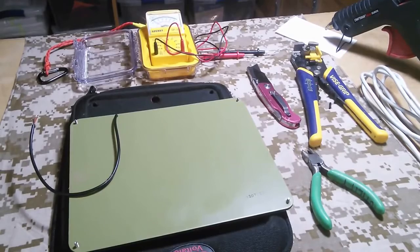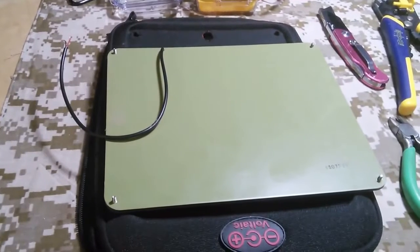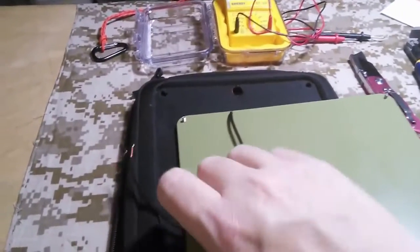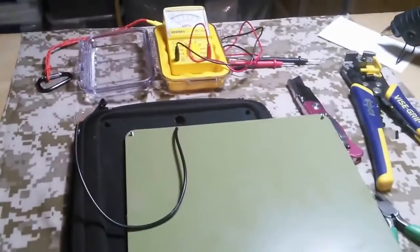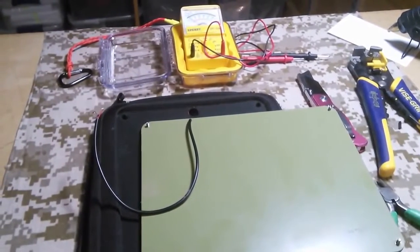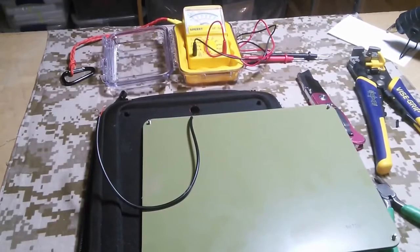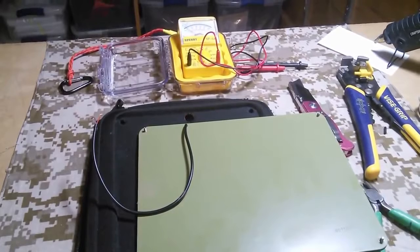So I'm going to get rid of the middle man. I've taken the solar panel out of the container, out of the little pack it's mounted to, and I've cut the barrel connector off. You can see here it's just two-strand wire, color-coded by polarity — I did check it with a meter. I'm going to feed that through and attach a USB female connector on the inside of the pack, so I can use any charging cable and connect pretty much anything I want.